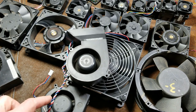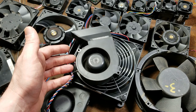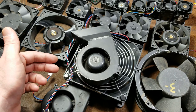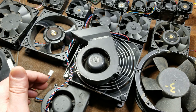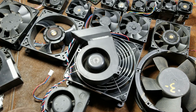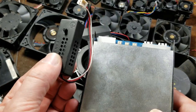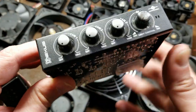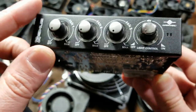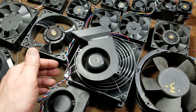This is a four-wire fan, and I've mentioned before they'll run with just the black and red wires and giving them 12 volts because these four-wire fans are computer speed controlled — but if they don't detect a computer, they just default to full power. That makes them great for working on projects. If you do want to control them, they use a pulse width modulator and you can get little controllers for fans. These are for three-wire fans — you can get inline speed controllers, or ones computer enthusiasts use, which are super cheap. This thing was like $4 shipped off eBay. You can get little fan controllers — it really expands the kind of projects you're involved in.